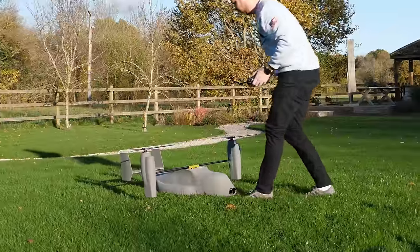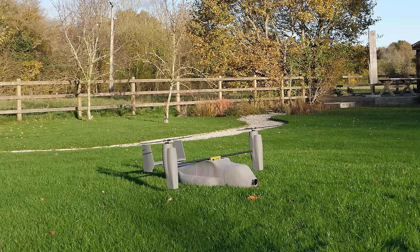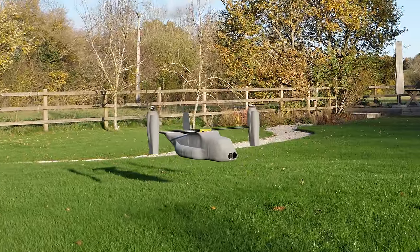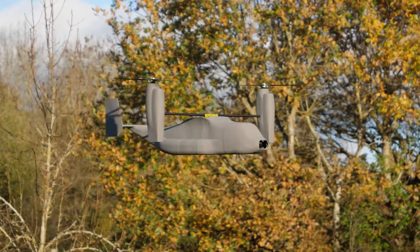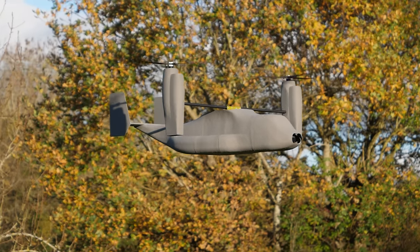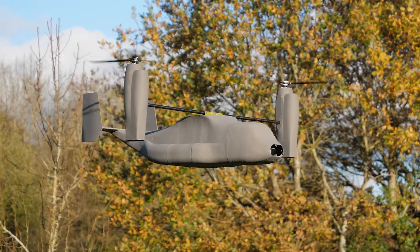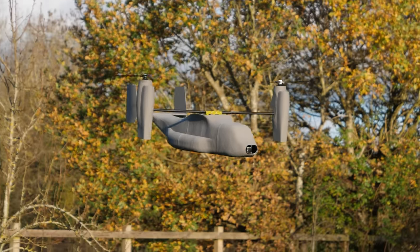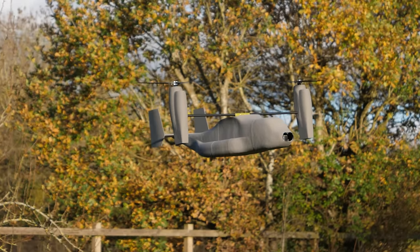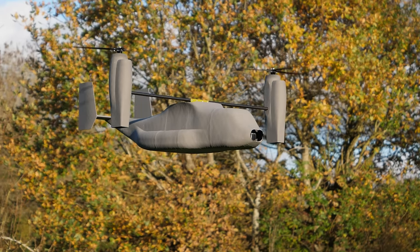Before building the wing, it's a good time to test if this thing will still hover with the added fuselage. The propellers vibrated a little to start as the blades were folded slightly for transport, but they soon straightened out and the aircraft lifted off the ground easily. I'm surprised at how well this thing flies - it's actually more stable with the fuselage attached, which is probably because the added weight and inertia dampens the movements. I'm also glad I moved away from the older rotor heads, as this system is far simpler and when hovering it's almost impossible to tell that the rotors are tilting.